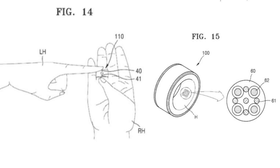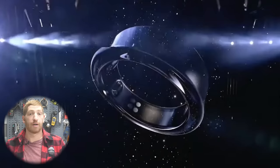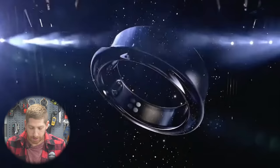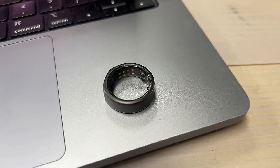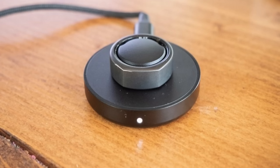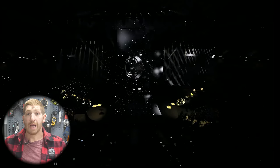This is a good time to point out that last year Samsung got a patent issued for a smart ring device that includes various health sensors — PPG as well as ECG — so heart rate monitoring makes sense. Doing ECG from a medical certification level, like Samsung does on their watches, is a whole different realm than providing that information without certification. Those four contact points on the ring are likely not for charging but for manufacturing — used to transfer firmware and run diagnostics in the factory. Charging is almost certainly wireless.